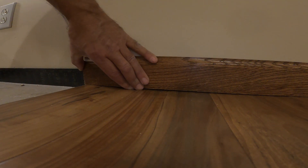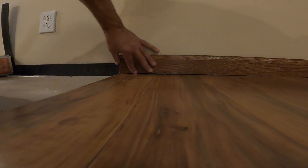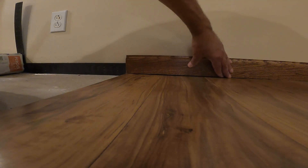When I put my baseboard down, they want this to be a floating floor — which it is. I'll probably put a 32nd or a 16th gap between the floor and my baseboard so it will have a slight clearance. I do not want it too tight because I'm afraid it might prevent the floor from shifting, which is what you want it to do.